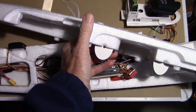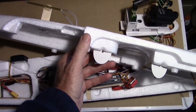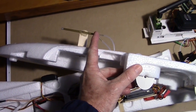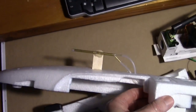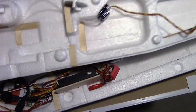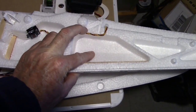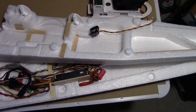The front edge of the wing is right here. So that's where the wing root is, or front edge of the wing is right there. And then the props come out to about the back of the tube here. And so I got all that sticking out in front of the props. Then it goes back to the module where the two readings are subtracted from each other to just get the wind pressure. And then it goes on to the Vector through the GPS, through the bus.